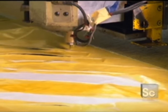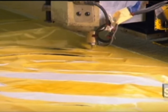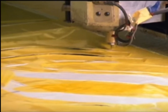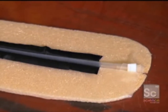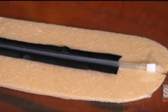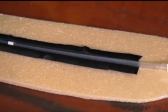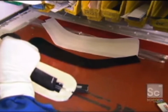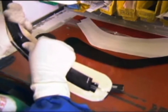The outer surfaces of the blades of the shaft are cut from the same carbon fiber sheets used on the shafts of the sticks. The outlining of this cut is made by a machine and the cutouts are removed by a human worker. The strong polymer sheets are needed to protect the interior of the blade, which is made up of a small bladder between two pieces of foam. The soft foam works to cushion the impact of the puck hitting the blade and also increases the speed of the puck when the player shoots. Workers wrap 35 layers of the carbon fiber sheets around the blade to ensure that it can withstand all of the force absorbed by shooting the puck.